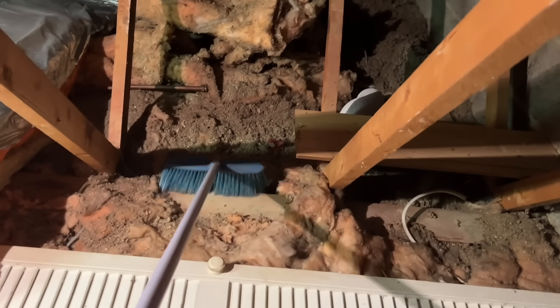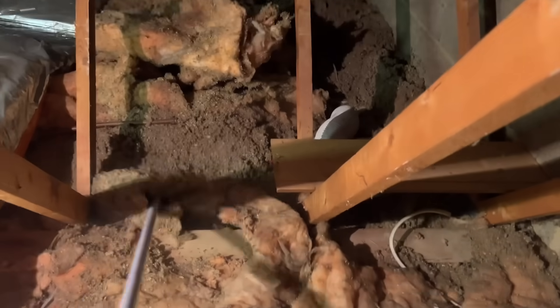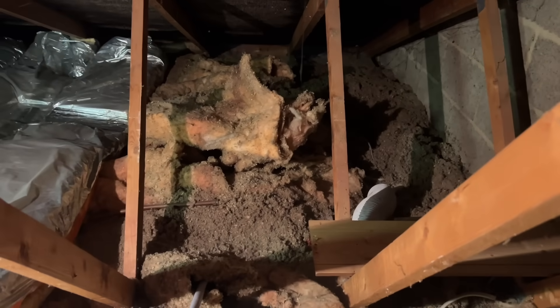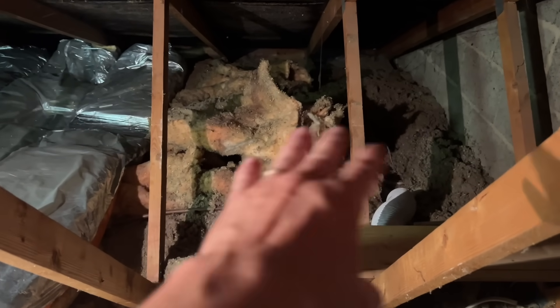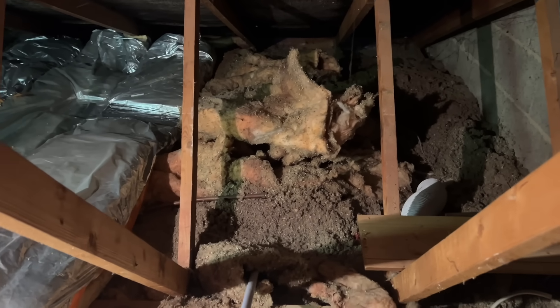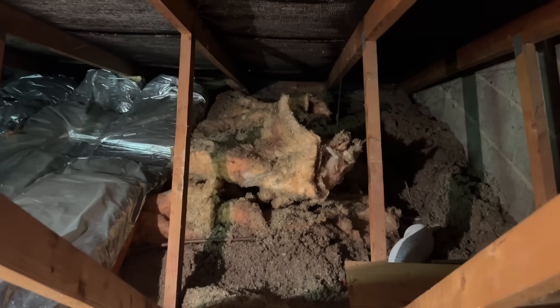You can't say sparks don't sweep up and hoover up, James. So I'm going to sweep this crap out the way so we can drill our lights without getting covered. Move where the stuff is for the fan, find the feed, get an RCD put in — put it all on an RCD up in the loft, mark the board, RCD in the loft for the fan, and then get the hell out of here.